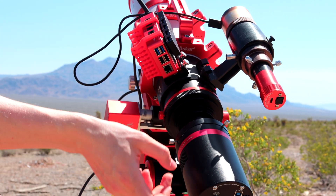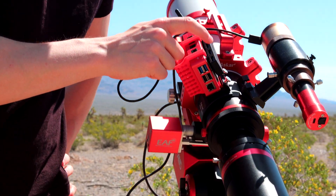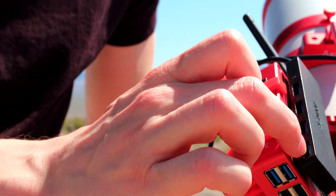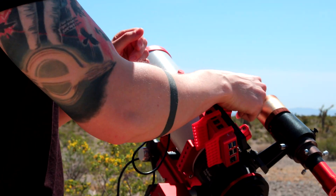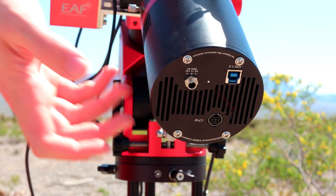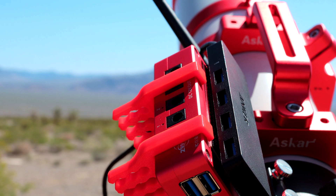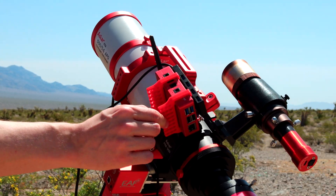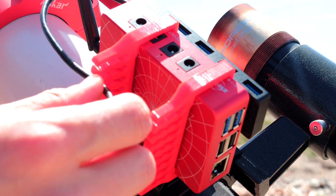For USB, since the QHY camera will not connect to the ASI Air directly, we connect it to this USB hub here, which has four ports. So we connect from the camera to the hub, and then everything else USB-wise goes to the hub as well. At the end, one cable goes with an extension to our laptop. If we use a ZWO camera, we can just ignore the USB hub and simply connect everything straight to the ASI Air. You might also notice on the ASI Air some cable management with 3D printed pieces, which are very useful for organizing all our cables.